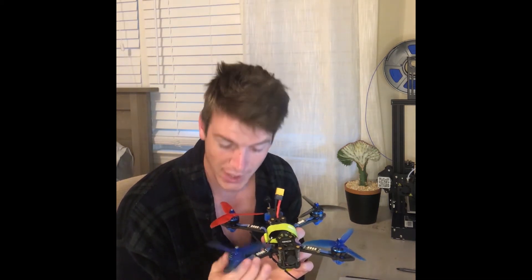How does this miscommunication feedback loop happen, and what can we do to fix it? Going back to when you're building your drone, depending on how you wired your motors, the motor will spin one way or the other. The good thing is you don't have to rewire anything — you can go into your software in Betaflight or BLHeli and change the direction the motor is spinning. This matters because if the flight controller thinks it needs to spin the front right motor faster to compensate, but that motor is actually spinning backwards, it has the opposite effect.